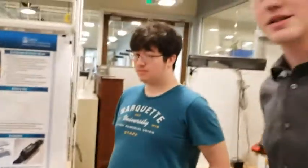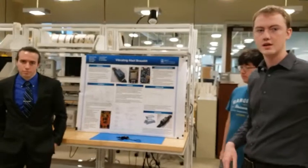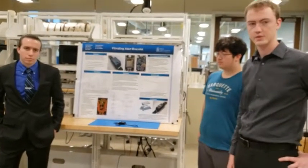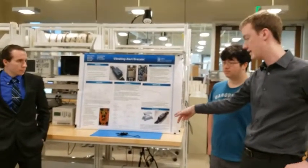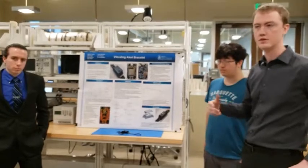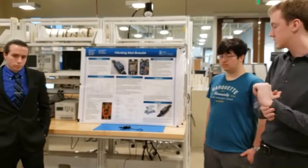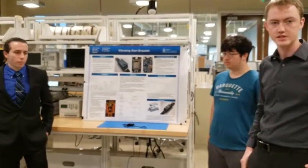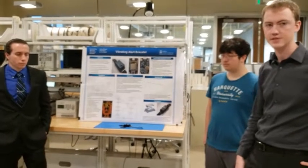Server-side, the software constantly gets polled and keeps a list of all the bracelets that are supposed to be connected to it. As this dynamic list is updated and maintained with the different MAC addresses for the bracelets, it keeps an alert state for each of the bracelets coming in, and then an alert state for your whole system going out. Otherwise, it receives constant updates from the app, and also from the bracelets. Each of the bracelets, it knows which ones it recognizes based on the MAC address of the ESP